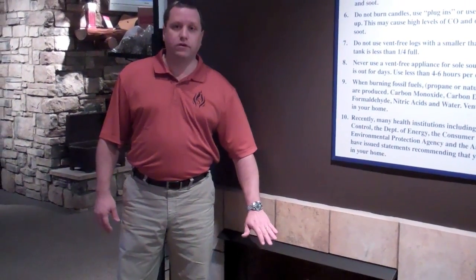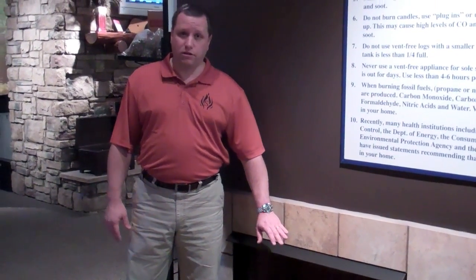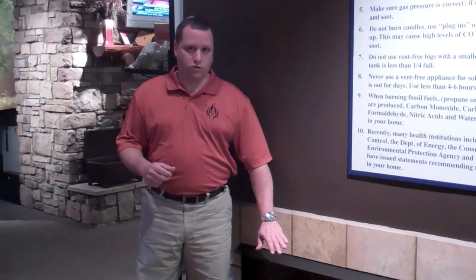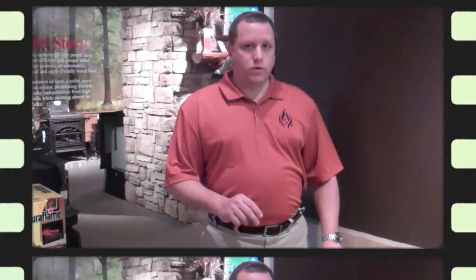That hot air feels great when you're cold, but it can fill that room up pretty fast and make it a little uncomfortable. That's why you'll see most people say, I run it 10 or 12 minutes and the room's pretty hot. Now, that can be beneficial if you're saying, I don't really care about looking at the flame for a long period of time. I really just needed to heat that room. I want to turn it up, get it hot, and move on. That's what non-vented was originally designed for.